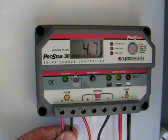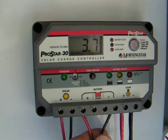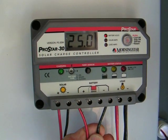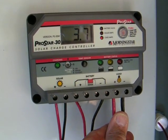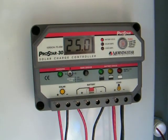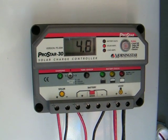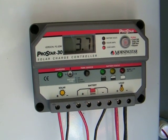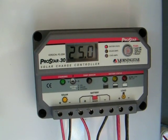The inputs here are from the solar panels, the PV array — 24 volt input. These two wires in the middle are the output going to my battery bank, which is now a 24 volt configuration. The wires over here to the right are the outputs going to the pump relays operating the pumps. Right now the system is producing 4.8 amps from the PV. I'm using 3.7 amps on my pump, and my voltage at the batteries is 25 volts.